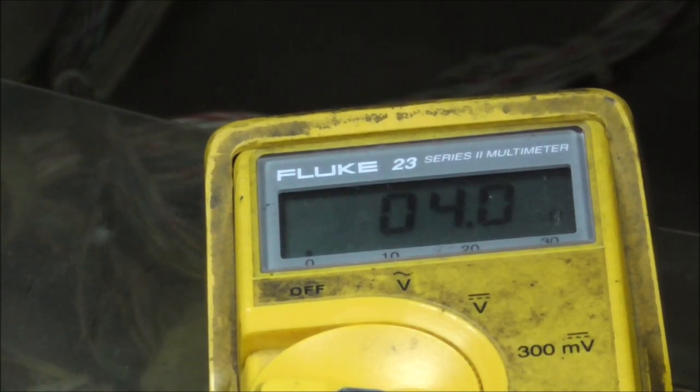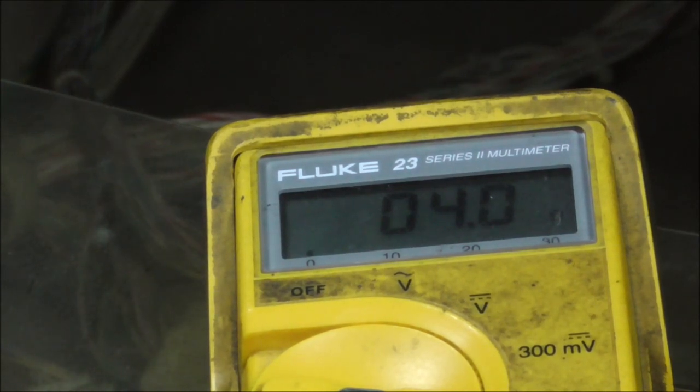So that, bam, it's gonna hit that damn thing quick. And that's why you get it where you slap the back of the game with the flipper. That's how you want it. You want them snappy. Okay, so then the flipper, bam, pulls up, and it opens up the switch. So it adds in the other 200 ohm coil because now that switch is open. And so you've got 204 ohms across it now, which is weak. You can hold that with power across it all day long, and it will not burn the coil up.